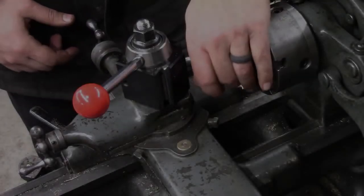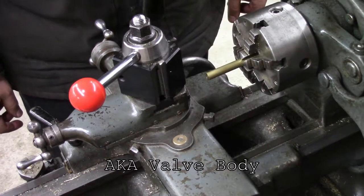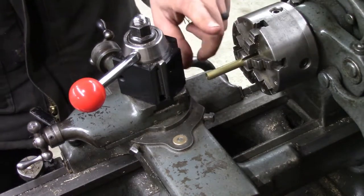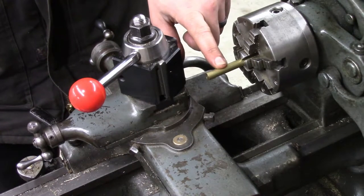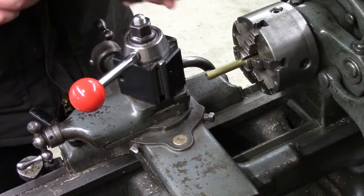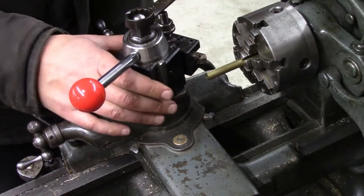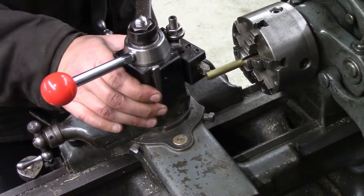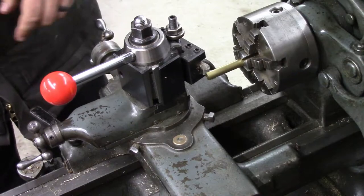So the next step is we're going to make the needle assembly for adjusting the gas flow. We'll make it out of this piece of 3/8 rod here. We'll turn the outside first. We'll make a hose barb on the end. We'll drill a small hole in the hose barb and flip it around, do some work from the other side. I don't need any real square shoulders in there, so I'm gonna use this tool. That'll also give a little bit of an angle on the shoulders there.